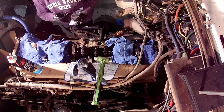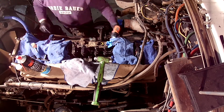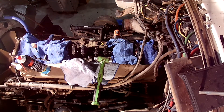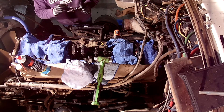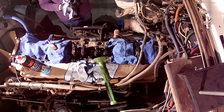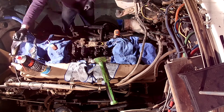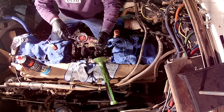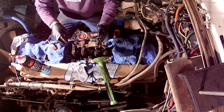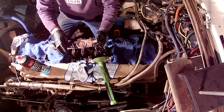The question I had when first introduced to all of this is why is there so much importance and focus on the turbos when choosing an engine brake from Jacobs? CPL does matter, as well as injector timing, MVT time versus fixed time versus STC time, as well as big cam identification versus small cam identification, but the turbos seem to be the big deciding factor among the engine models.